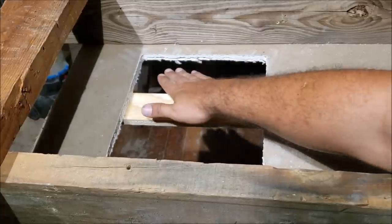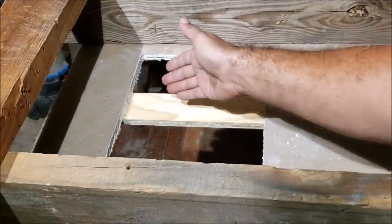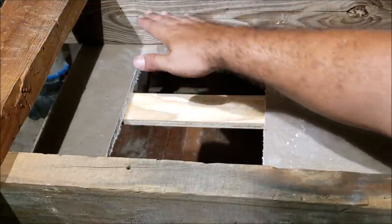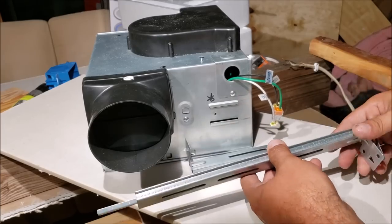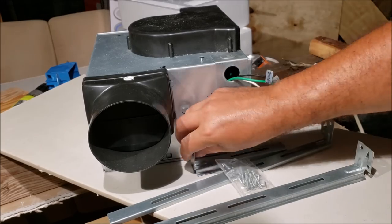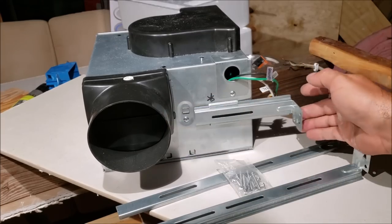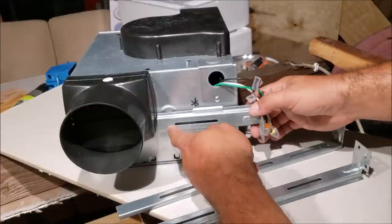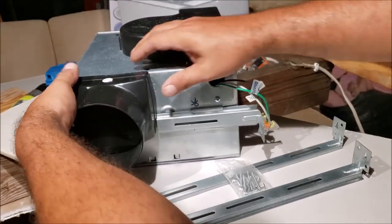The unit has to be set flush with the sheetrock, so you'll need somebody to hold it or screw some sheetrock tabs. This piece of plywood will allow the unit to sit down comfortably while we fasten it to the ceiling joist. Now get the unit ready to mount — you'll need the three brackets and the little pack of screws. The hangers slide in, and the smallest one goes on the vent side. If you want to mount this flush against the ceiling joist, you'll have to cut about an inch off right there where the vent's in the way.